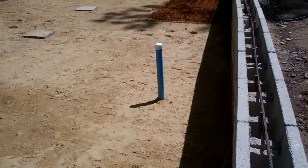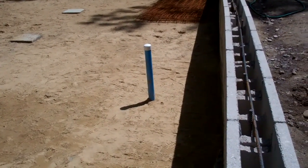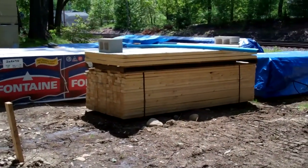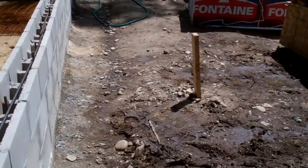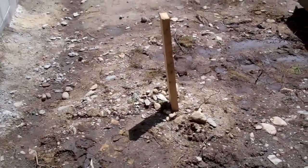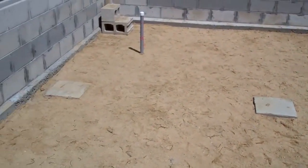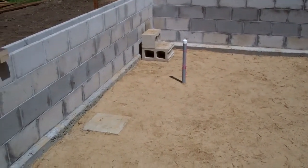Here's an update: I dug out the old water pipe, which was corroded. There's a two-inch sleeve that the new tube can go through, but I have too much stuff in the front lawn to dig it up right now. So I just buried it underground. I also buried a 2x4 that goes to the cap, so in the future I'll be able to follow that 2x4 down and find the sleeve to run the tube through. Over here I buried a one-and-a-quarter inch conduit underground.